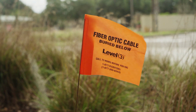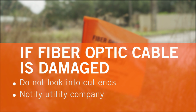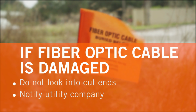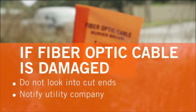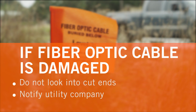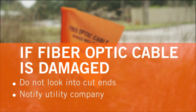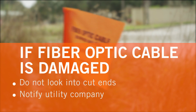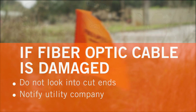During the drilling process, if a fiber optic cable is damaged, do not look into the cut ends of the fiber cable or unidentified cable. This can cause severe vision damage. Damaging a fiber optic line can interrupt emergency communications. Therefore, notify the utility company immediately.